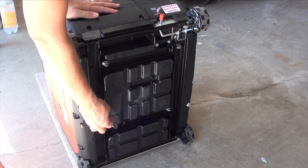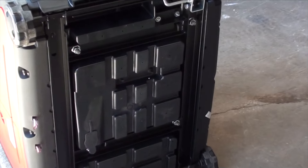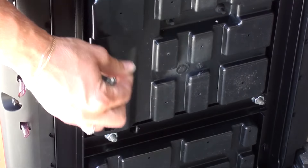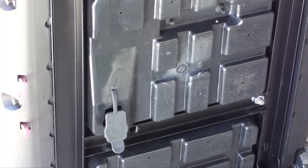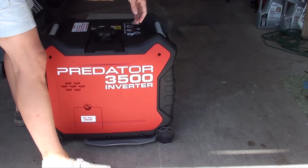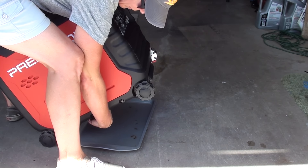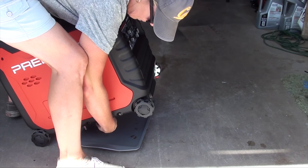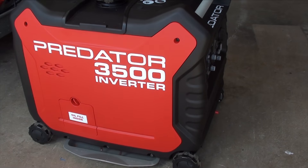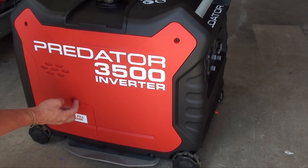What we're doing under here is this little rubber plug right here. I'll zoom in a little bit so you can see it — that guy right there. So you open that up like so; it dangles like that. I lift it to make sure that little flapper plug is out of the way and facing the right direction. Once you've got your pan and everything under there and the little plug open, you take off this little thumb screw, this little panel here.